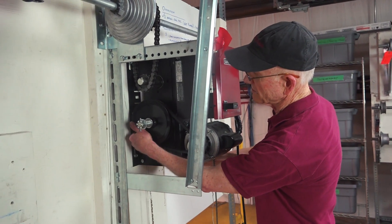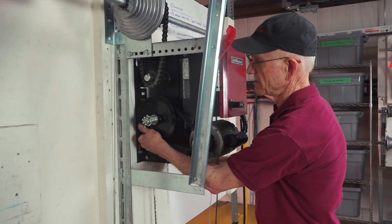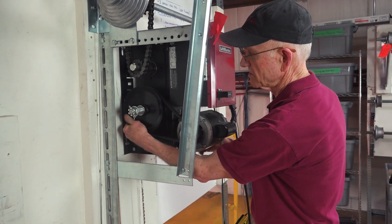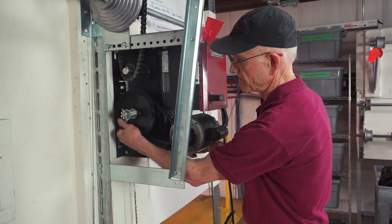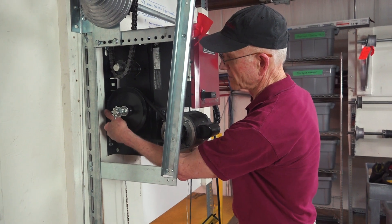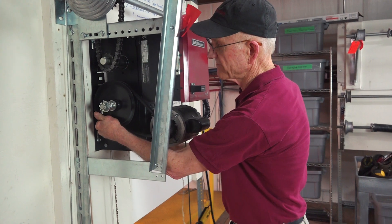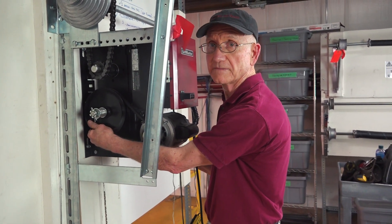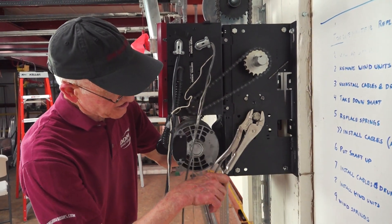Notice that if I hold this with my hand, I have a vice grip on the other side and the clutch slips as I hold the drive pulley. Normally it just turns, but if I'm holding it, I can still turn the shaft. That means that the shaft is turning inside the clutch pressure plate — the shaft is turning, but the pulley on the other side isn't turning.